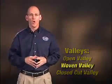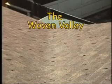First, we'll look at the woven valley. This is the weakest valley and should only be used with 3-tab shingles. This technique should not be used with GAF Elk laminated shingles because of their thickness. So we'll install a woven valley with 3-tab shingles. Remember, valleys are a prime leak area, so it's important to be extra careful.